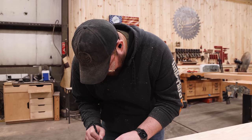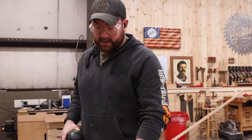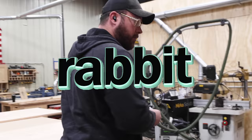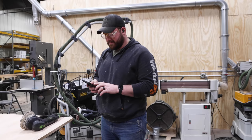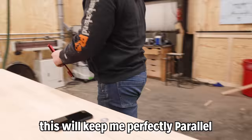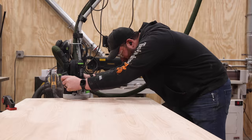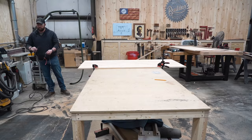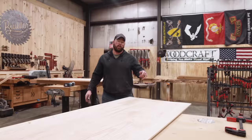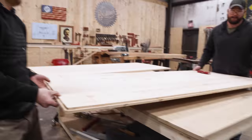When you're using this method for your interior door panels, there's gonna be a rounded edge - you can see how that rounded out. We found a washer that matches the radius of our cutter head, so we're just gonna trace that and round these off, then route our rabbet. We're doing a little chamfering to help the panel go into the groove, then we're gonna mock them up and draw what's gonna be an awesome power carving.